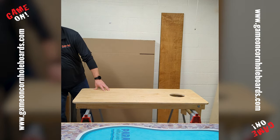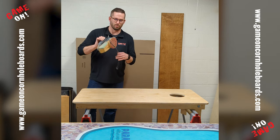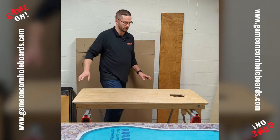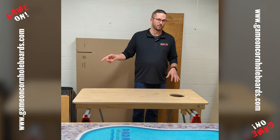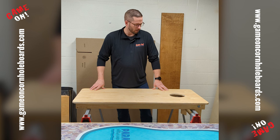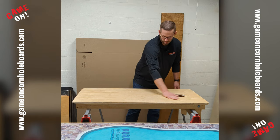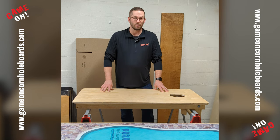Pretty simple on this one. When the top is bare wood, I use an orbital sander — this one had 220 grit on it, nothing crazy — just to smooth the top down. Then I throw a coat on, let it dry, and use 320 grit sandpaper by hand, just enough to make sure it's cleared up all the way. Let it dry all the way down, make sure there's no burrs, nothing that's going to cause a bubble or a defect in the wrap. That's a prepped top in my book.